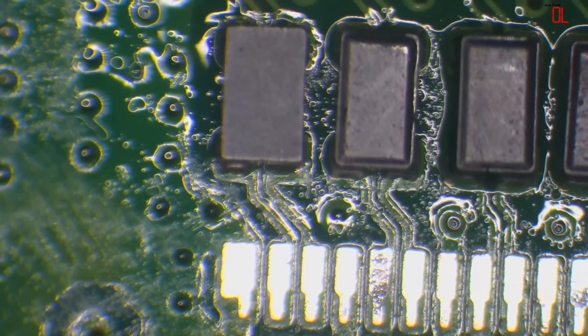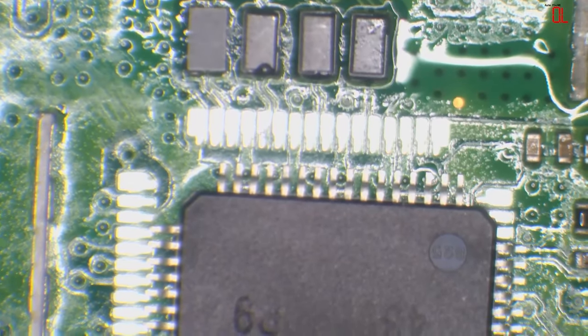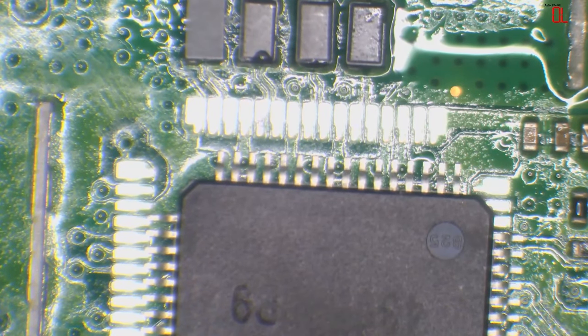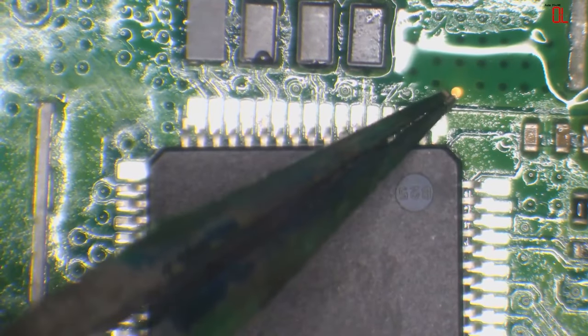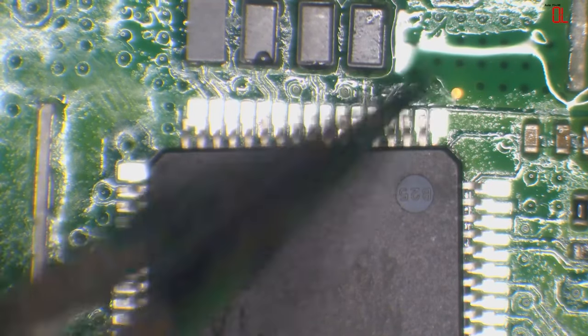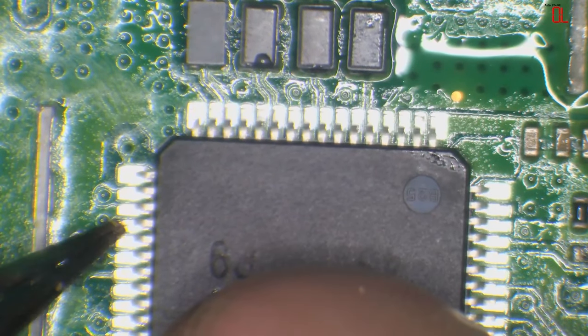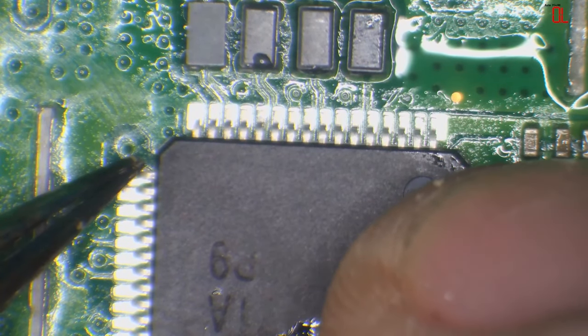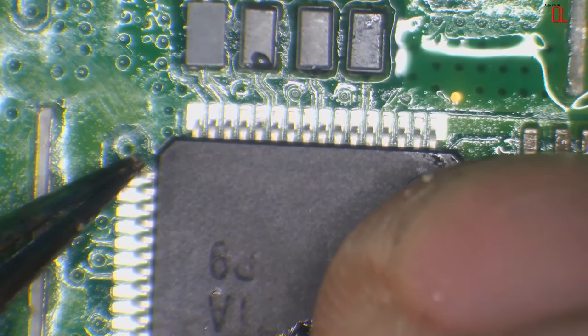That's fine. Right, so with the chip, it's going to look like I'm putting this on upside down, but I'm not. So where the B25 is, that's got to be top right, where that B25 symbol is. And you can see that is indicated by this gold dot here. So the way I do these, I'm going to get it lined up. To do it this way, you've got to line it up fairly perfectly. I'm going to get that lined up.